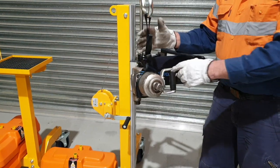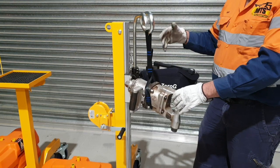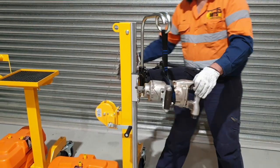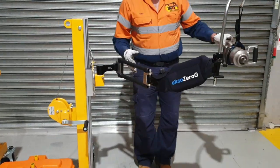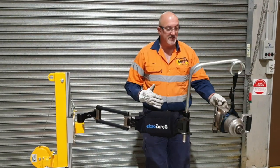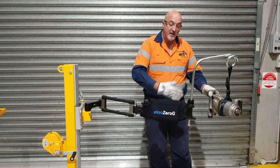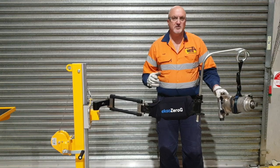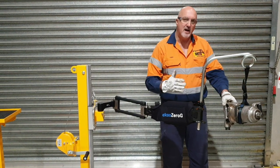To make sure you're getting the maximum efficiency out of the tool arm itself, it's really imperative that you make sure it's adjusted correctly. I'm going to take it out of the gravity latch. See how the arm is on the horizontal — I can move this with two fingers. You have 430 millimeters of dynamic movement of the arm. The critical thing is to position the arm on the horizontal so you're working in the same plane as your job.